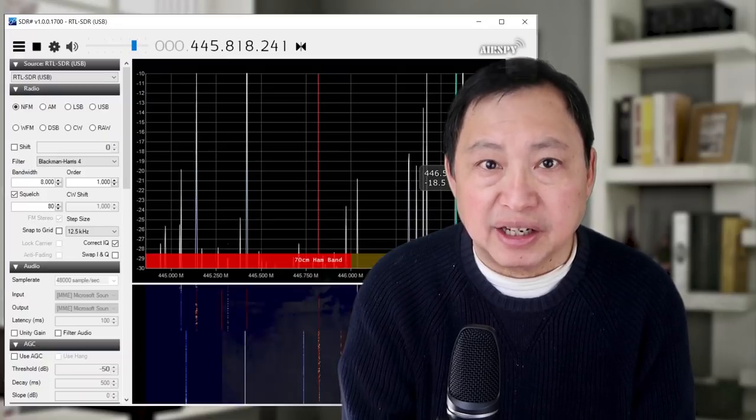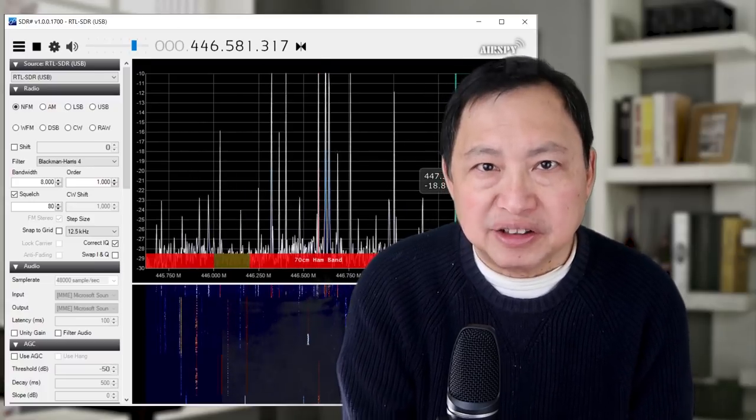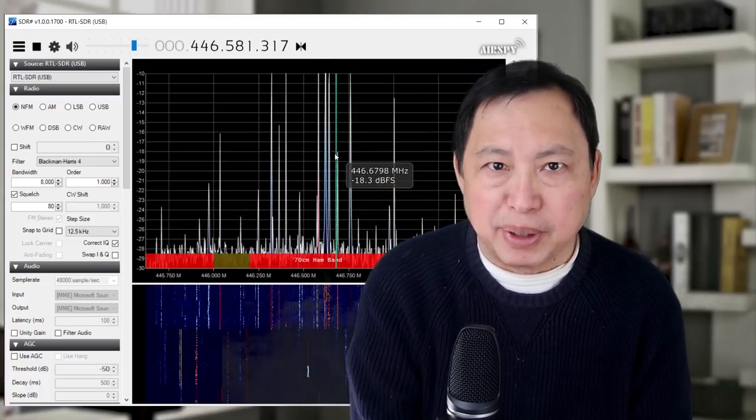So the actual length we need is approximately a foot. Divided by two segments, we need around 6 inches apiece. Unfortunately, the short antenna is slightly shorter than 6 inches, so we'll have to go with that. Just use the small antenna extended at max for each of the elements. Now we can listen in on the 70 centimeter ham band.